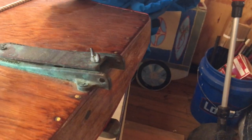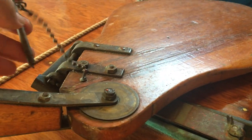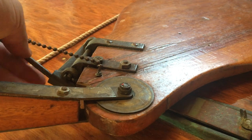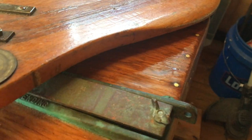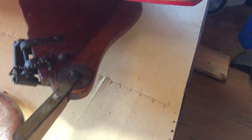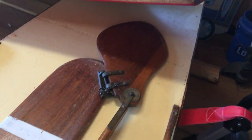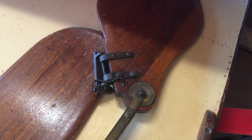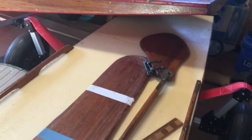One tip about these rudders is they have this very expensive rudder pin. In the original boats, their chain goes onto the deck. You go down the highway, chain breaks, pin falls off. So what we recommend doing is, like we did here, hooking the chain to the rudder. That way the rudder and the pin all stay together.